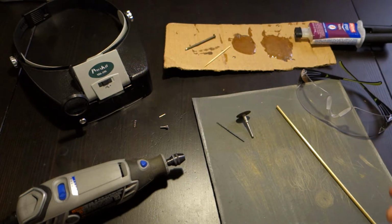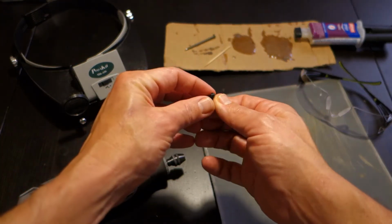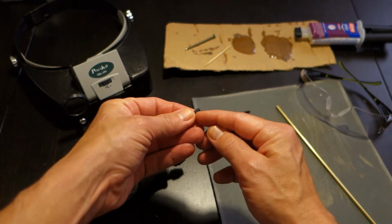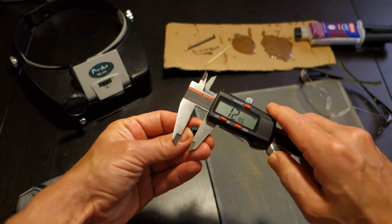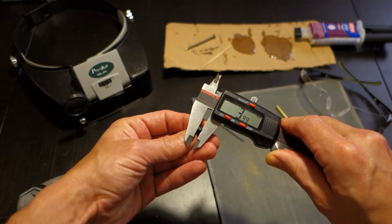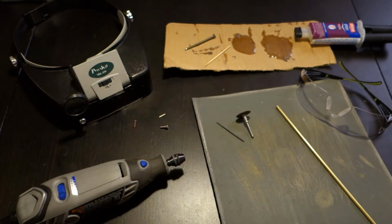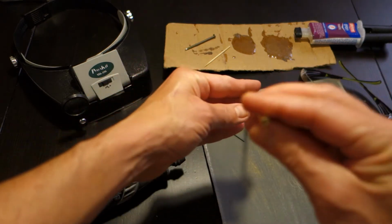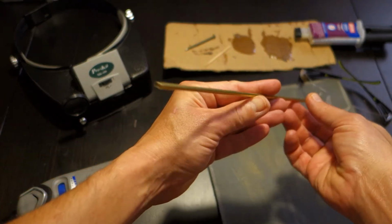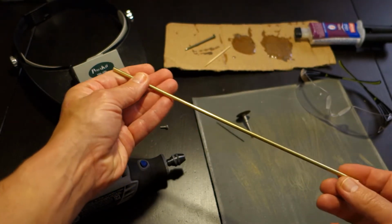All right, in terms of materials, first of all, we need to think about what we need to replicate this guy. One part of this, of course, is this shaft right here. I measured this shaft with my calipers, and I found out it is about 4 millimeters. Well, I got real lucky. As it turns out, I had this 4 millimeter brass tube in my garage from another project. So you're going to want to pick some of this up. And I will leave links for all of this stuff in the description as always.